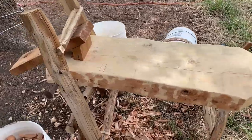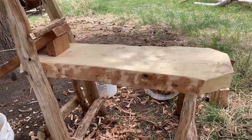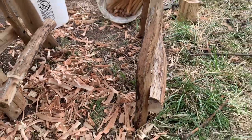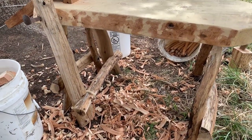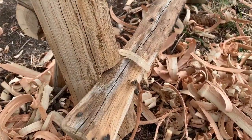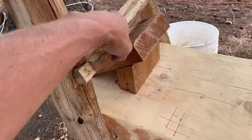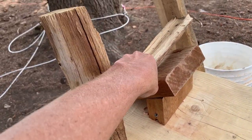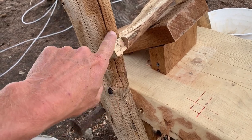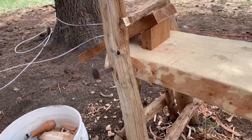Here's the shave horse that I built with a slab of spruce I milled with the Alaska chainsaw mill. All of this oak was victim to a brush fire here on the property — as such it is extremely hard. It's heat-tempered, so I was having some difficulty with the screw head snapping off and that sort of thing. This piece has a little play in it, but the pressure when you're working is between the holding bar and the legs, so we'll use it until it falls apart and build it right.